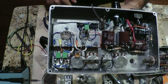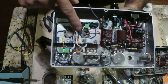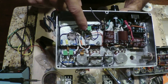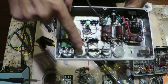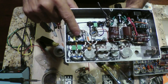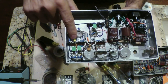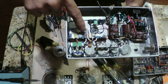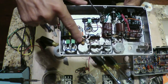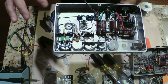More time has elapsed. We've done a little bit more wiring here. We installed another terminal strip here to run the cathodes for the cathode follower, the cathode resistor, the cathode bypass cap. We finished up the wiring of V1A and B in terms of making the Jose circuit here. We have the preamp circuit, right? That was the one that was on the push-pull. Now we have the associated secondary gain stage, which would be the bright channel with the 4700 puff bright capacitor there. We still have our tag strip to fill out for the tone stack.